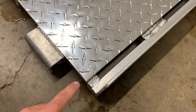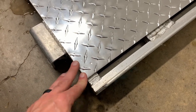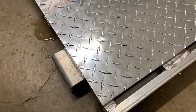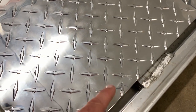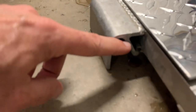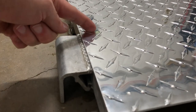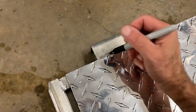The diamond plate is on and it fits very well — it's pretty much the exact size I figured. I did hold it back off of the edge a half inch on either side to make up for these welds, because the welds kind of stick up a little bit. There was no way for this plate to fit flush up against this channel because of the welds. It is more or less bridging over the weld, so I'm debating on whether or not to cut this out so that the plate can fit completely flush.